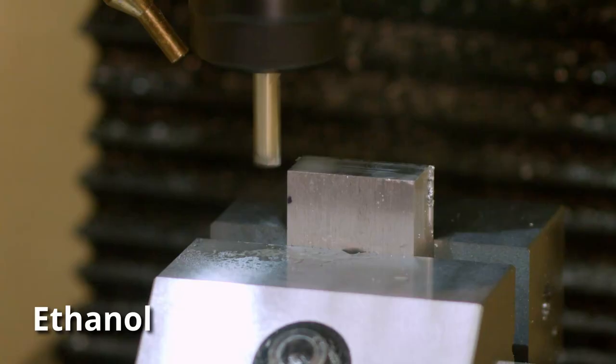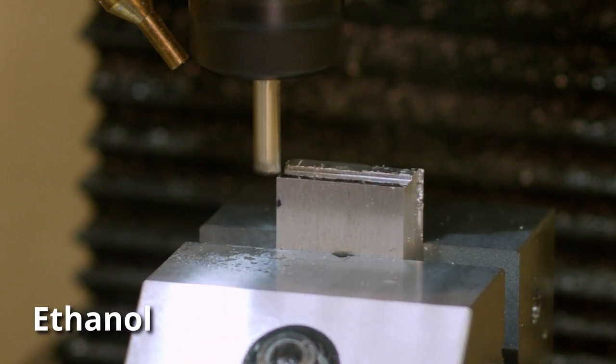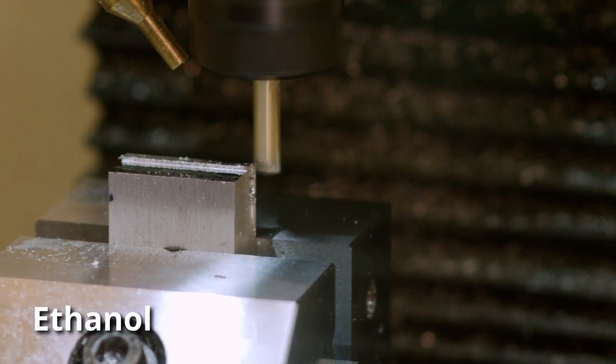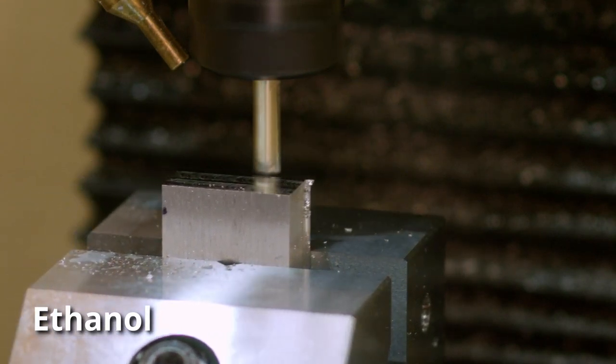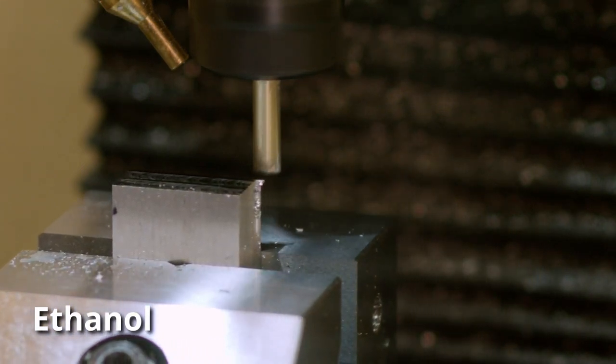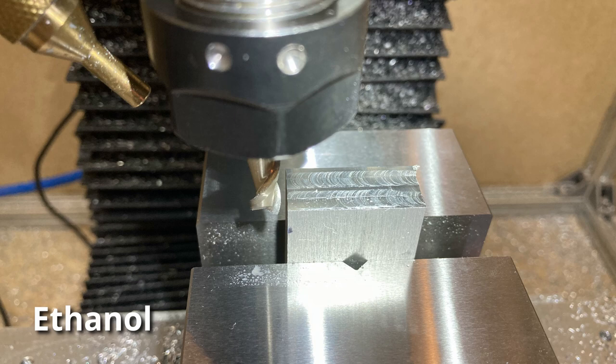This is 6061 aluminum. Here I'm using ethanol as a cutting fluid. Ethanol is apparently used in Europe more often than in the States — if you look at the Datron machines, for example, they use an ethanol coolant. This is 95% ethanol, denatured with isopropyl alcohol. It definitely kept the part cool, but as you can see it didn't really improve those semi-circle stacked coin imperfections that much — a little bit better, but not a lot. One nice thing about ethanol is it did reduce cleanup; it evaporates almost immediately. So the part came out without any debris on top, which is great compared to stickier cutting fluids that tend to leave more of a residue. It had a nice smell too, definitely like a bottle of vodka. But in terms of actual surface finish, it didn't really improve very much.